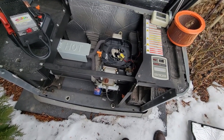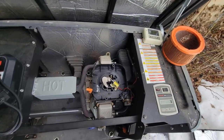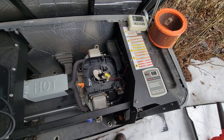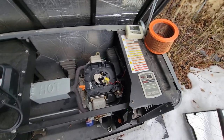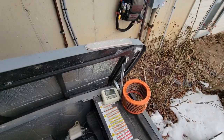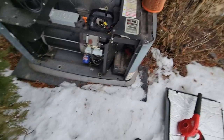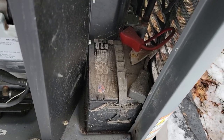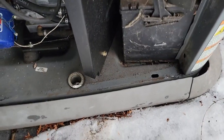I like playing with the air intake to see if it counters it — checking that it's paying attention to the frequency it's trying to maintain, which should be holding right at 60. This is a Honeywell — might as well call it a Generac because Honeywell doesn't really make it. The number one killer of a generator is the battery. This is a maintenance-free battery, which means you can't maintain it. Let's see if we can get this thing out without shorting it out.